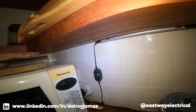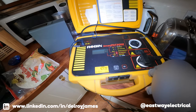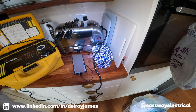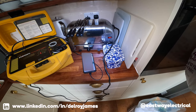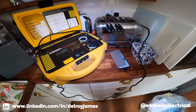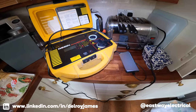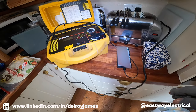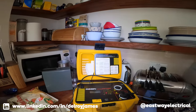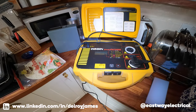I don't know if that's part of the problem. From what I can gather from the tenant, the oven was tripping the RCD at one point, but then they got someone in to do something to the oven and it was fine. Last night they were doing a pyrolysis cleaning cycle where you have the oven on all night, and everything was fine. Then they came to make a cup of coffee this morning and it tripped when they turned the coffee machine on.